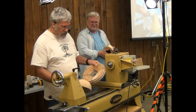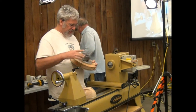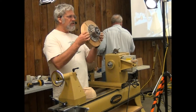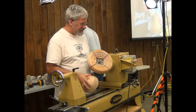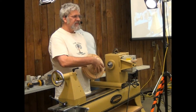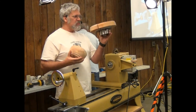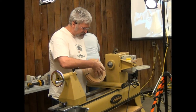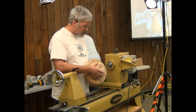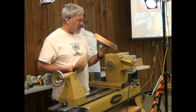If you don't have the money for a vacuum chuck but need to reverse turn bowls, start out with your standard scroll chuck jaws and add some boards to them. You can custom machine this down to match whatever bowl you're turning at the time. It'll grab it quite nicely and allow you to turn the tenon off. This is my wife's favorite way to turn a bowl around and take the tenon off.